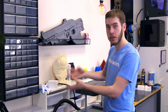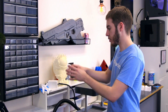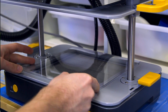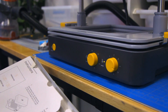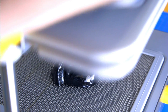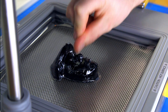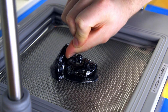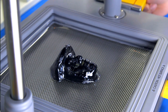I'm going to do that today since that's what the instructions say, and I want to show you how that works. You're going to take the plastic, put it in here, turn up the heat to the temperature printed on the case with the plastic sheets, turn the timer to the same setting, and then once the timer goes off, you drop down the plate with the plastic and it will turn on the vacuum. I'll just wait a couple of seconds, and when it's done it should turn off.